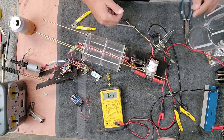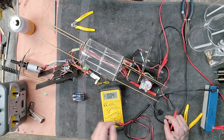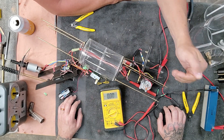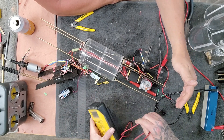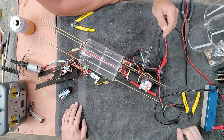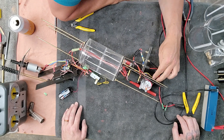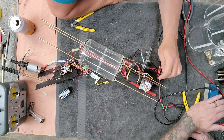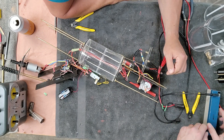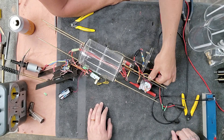Let's eliminate the switch from the possibility. To recap what we were doing: we started with power on the outside, just as though it would be connected to the main drive battery — we got nothing. Bypassed the power switch in case that was faulty — still nothing. Bypassed the fuse in case that was the problem — still nothing. Now this speed controller's not happy, and it's smoking hot. This battery's on fire — it's hot. There must be a short somewhere. The ESC is smoking hot too.